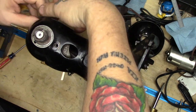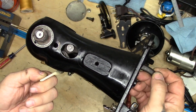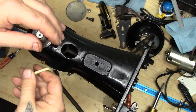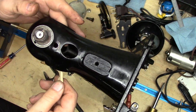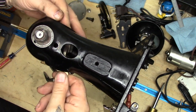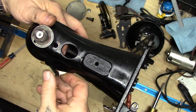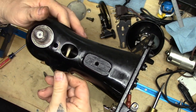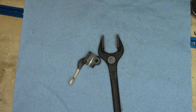Get that bolt with the lock washer off, and we can remove the back cover. Now we can simply remove the fork. Getting this out is a bit more of a challenge — it's going to have to go out the back. Notice it's got a tab on it. I'm going to rotate the tab so this portion points down, then kick it over and push it out through the back, but I have to move the main shaft first. Got it down and it's out the back.